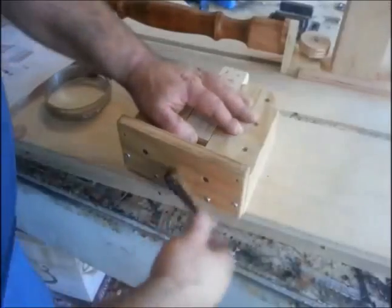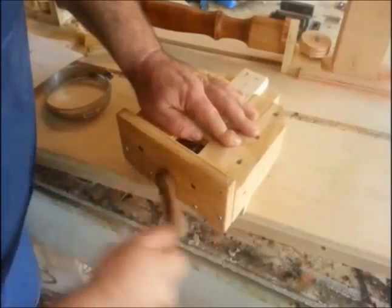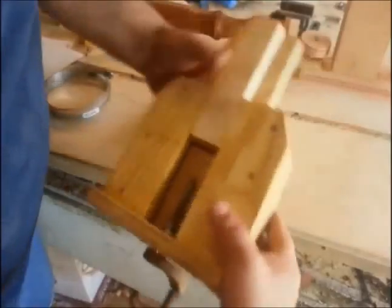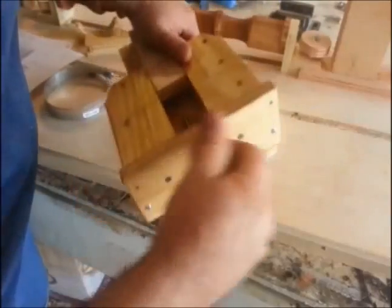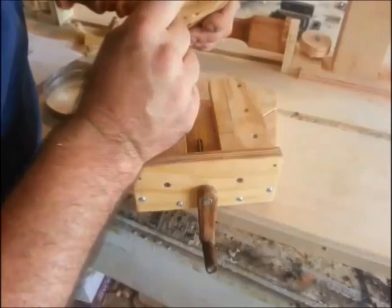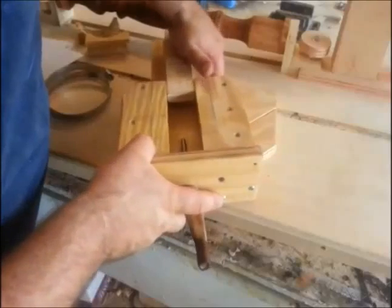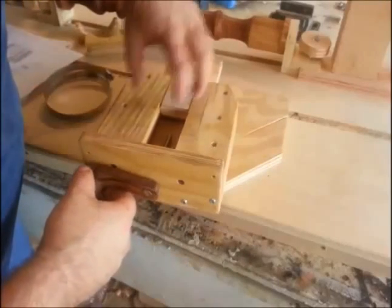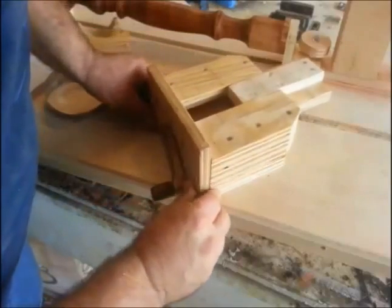Rather than rebuilding the router sled, I'm just going to use the old one I have and tweak it a little bit. This one's fully adjustable — I've got a 5/16 bolt in here with a handle on it, and I put a T-nut in here secured with a couple of screws on both sides so that slides in there. I can move this back and forth, the router sits on top of that slide, and then I'm just going to screw it to this base to add some height.